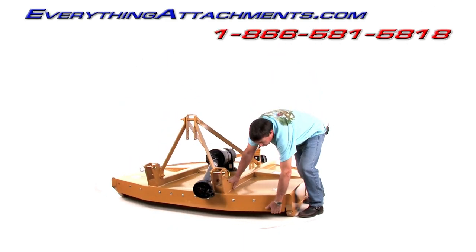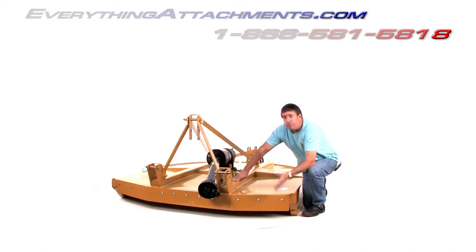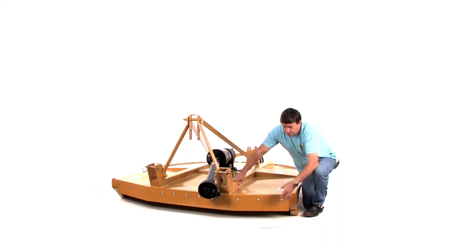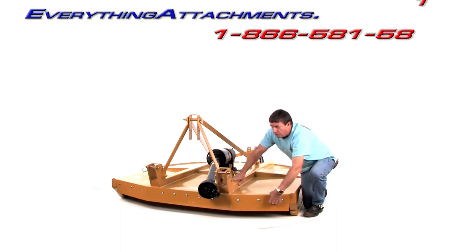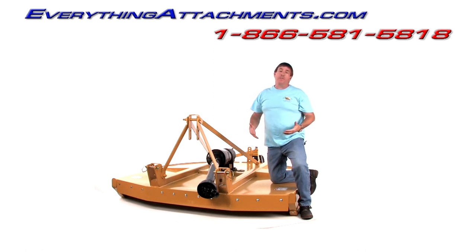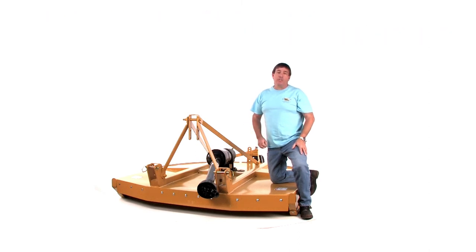On the front band, it doesn't come down as far, and if you're around people, you should definitely keep this band on here. You can remove it on the front — you're going to get a little dustier on the tractor. It does a lot more good to take the back shield off than it does the front. If you're going to be doing some really heavy cutting — big trees and stuff — you're either going to bend this guard or you need to remove it. There's a 3/16ths thick channel welded right here, top and bottom, to give you a lot of strength to help push those saplings and small trees over. This is a class 5 shaft, and at Everything Attachments, we've done everything we can to give you the best value on the market for your new rotary cutter. If you've got any questions, give us a call or an email at Everything Attachments and we'll be happy to help you.